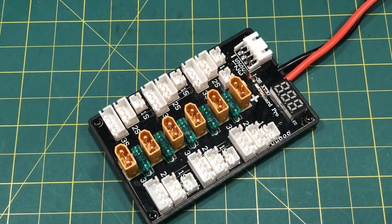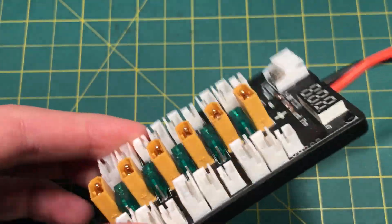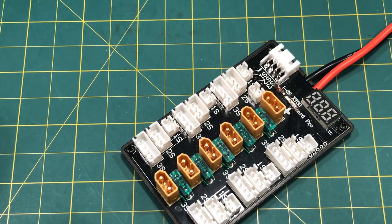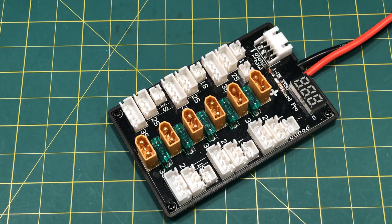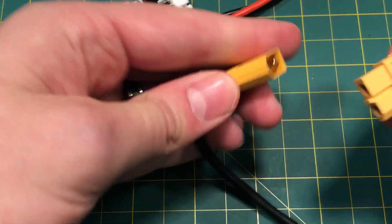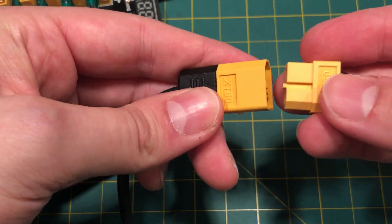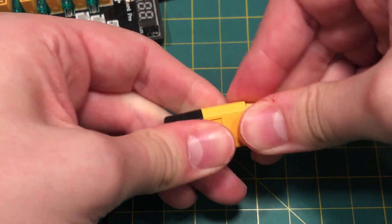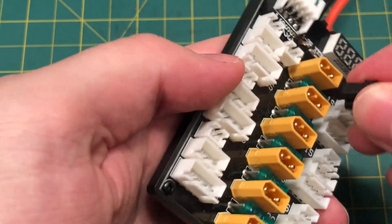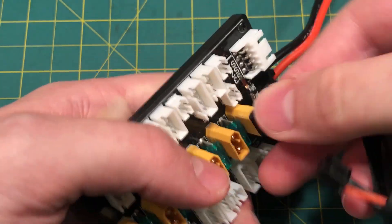I take responsibility for plugging the battery in backwards — I should have been paying more attention before I plugged it in and burned up the little fuse. Thankfully, it did have the safety feature to cut it off. But there's really no way to fix this. The board is dangerous right out of the box because I don't care how careful you are — there's always a chance you're going to make a mistake. The entire point of the XT30 design is that it stops you from making that basic reverse polarity mistake just by design. And if you don't have that, you're missing a huge part of the safety. I can't force an XT60 backwards into an XT60 — it's just not going to happen when the connectors are well made. But this board? Easy, easy, effortless.